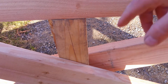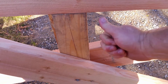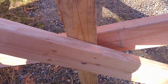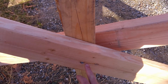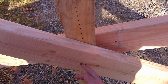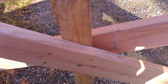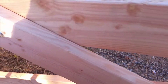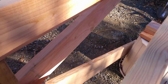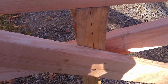You know, it forms two 90-degree triangles. So as these two legs try to fold up, they push this member up against the bottom of this. And that's the reason now that this is very stable and holds itself in place. And I bought just one of those ledger bolts or ledger screws, 4.5 inches long, to hold it all together. And then this is screwed in 6 feet out, and it's an 8-foot piece. And so as I raise it, this bolt keeps changing position, and that keeps getting brought back up.